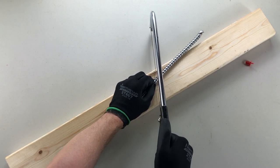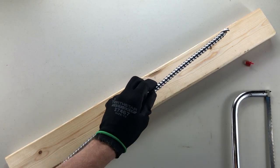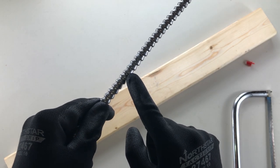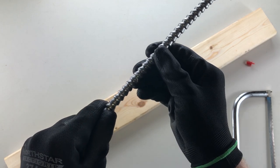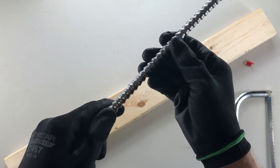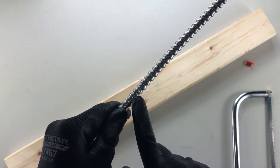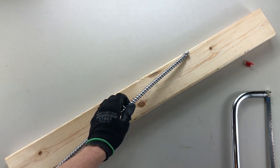Once you get a channel you can gently cut. When you're doing this for the first time, especially if you're new, you want to inspect the part that you're cutting to make sure you're not damaging the wires underneath. We have just a slight cut here and haven't quite broken through yet — that's good. We don't want to cut right through and risk damaging what's underneath. Inspect it while you're cutting, verify it still looks clean, and then resume.